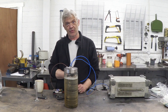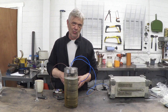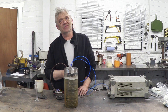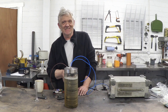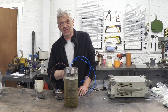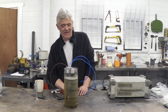Obviously you could play around with the plate geometries — maybe interleave them, make them S-shapes, maybe dual column together, maybe multi-point wire attachment. There's a lot of playing around with the geometry. But the main thing is how easy it was to make. I've tried the other electrolysers and to be honest, cutting those stainless steel plates, drilling them, bolting them, and using nylon rods to keep them all separate — I found that an absolute pain. So this is certainly a much easier way to make an electrolyser.